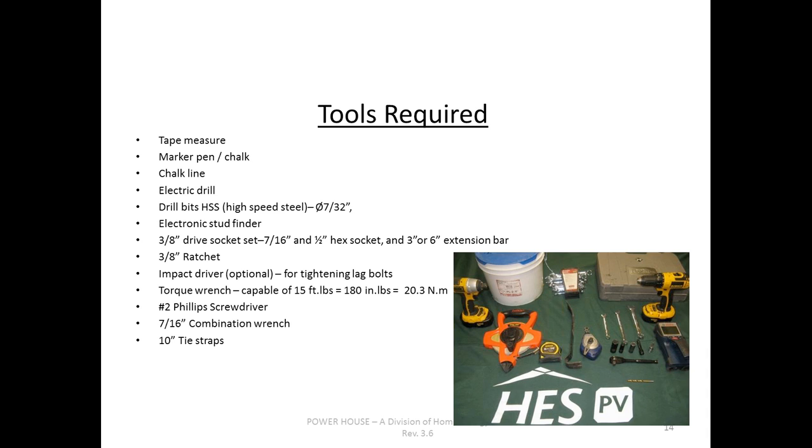There are huge savings to be made by doing all the prep work. If you're at site and find out you're short parts or mis-ordered something, it's a pain to go back and get the new part. One of the benefits of Fast Rack is the limited number of tools required — the main tool is a 13mm socket, with which you can complete all the different connections and bolts. It's important to have a number of them on site in case you drop one off the roof.